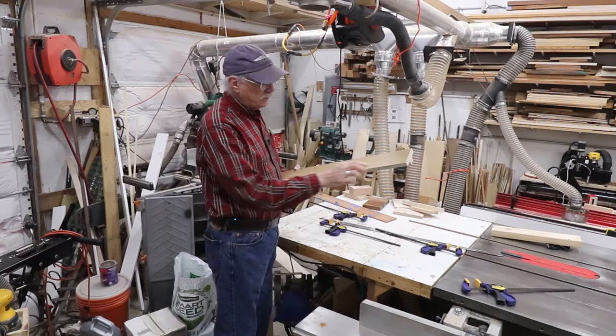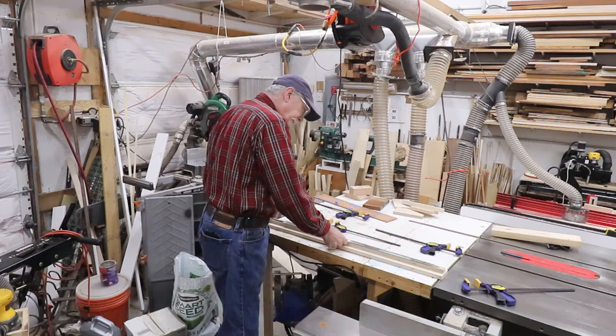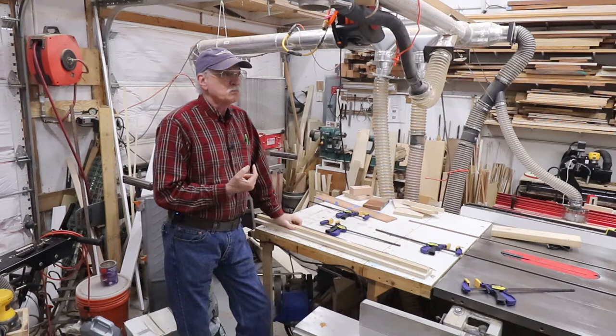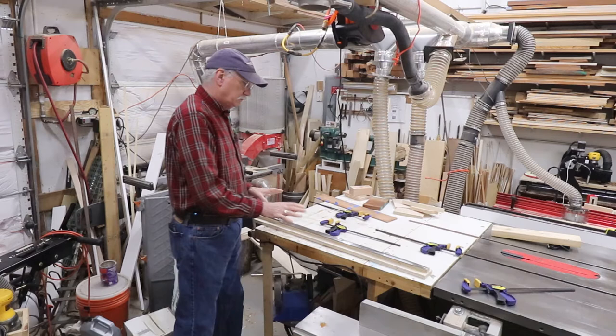The base can be clamped just about anywhere. This piece of plywood here is what the blade is going to ride on, sitting like this. That gives me clearance to be able to grind in these directions and not interfere with any wood. The way I'm going to hold it is with some screw-on rare earth magnets — I'll screw in three or four of these on here. At that point, I'll just clamp it down, let it sit magnetically in place, and it will stay where I want it.